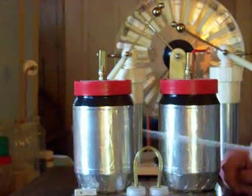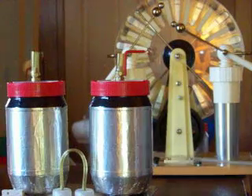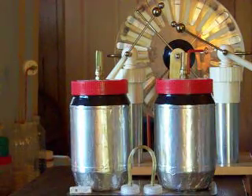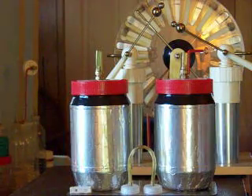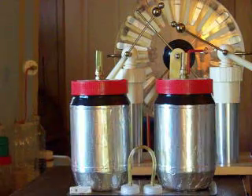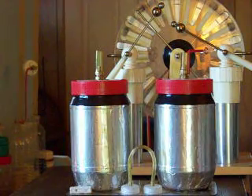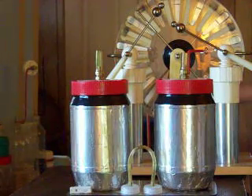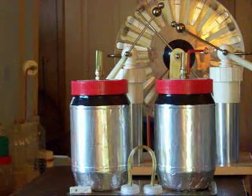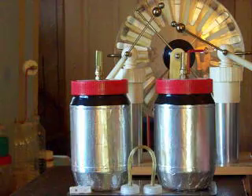Here's the bridge on the Wimshurst — both can be removed. This one just uses a couple thumb screws and swings out of the way; this one you have to pull them out. I'm going to leave them together because I want to show you how much more current we get. We're still going to have 70,000 volts, but we're going to increase the joule value — that's voltage and current put together.